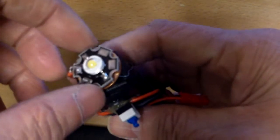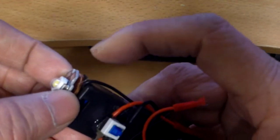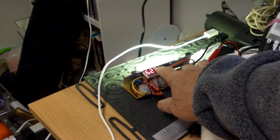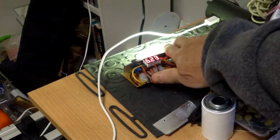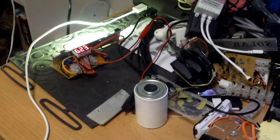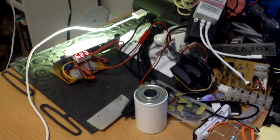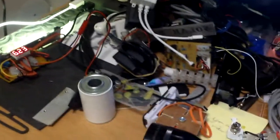Because this is attached to a heat sink already, it's pretty cool — it hasn't gotten hot on me. I just put a copper penny just in case to heat sink it. My other 2 watt LEDs here on a heat sink are at about 6 volts instead of 7.2, and they're only very slightly warm, because I brought the input and output voltage as close as possible to 6.2 through the LM317, so nothing gets really hot.